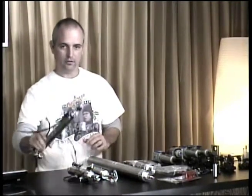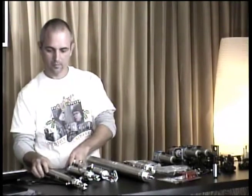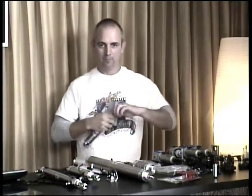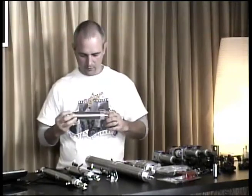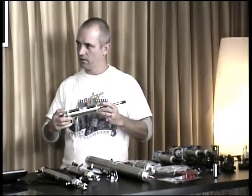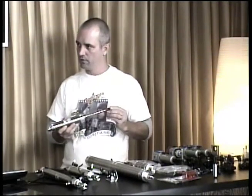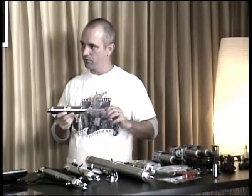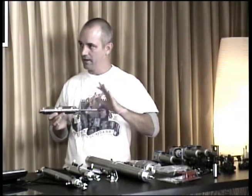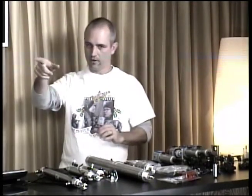We've got different styles of mounting for these, which we'll cover in just a second. Single acting and double acting. The difference is, say this one here is a double. It's hard to see here, but it actually has input and output ports on this cylinder. So you're going to pipe in air on both sides, so you can control direction of it in and out of the cylinder itself. On a single, I don't have one here on the table. I do have one up there on the demo.